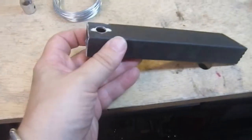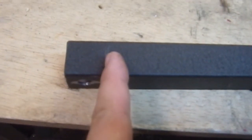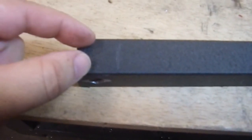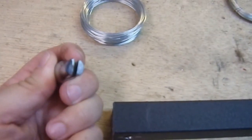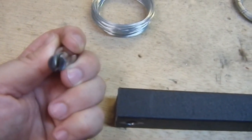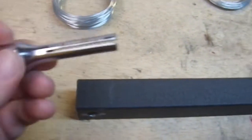We've achieved a new stage — the hole is drilled in. I've laid down this little line showing the depth I'm going to cut. I'm going to cut slots so that the only thing left will be the walls here. And this is already done — I cut the length and I cut that slot in. You can see that slot right there. I just free-handed it, aimed for the center and went for it. I did have to change blades — the first cut-off blade wore out, so I put a new one in to get the second half of the slot done.